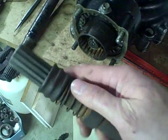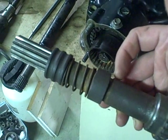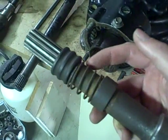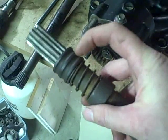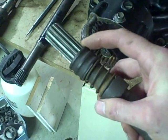This is what the shaft looked like when I got it out. It has this collar right here which doesn't exist in the parts list. I confirmed that it's just pressed onto the shaft so it can come off. This spring was sandwiched in there, and then this — which is actually the inner race of what was left of the double ball bearing — was pushed on there. So I pushed all this off.